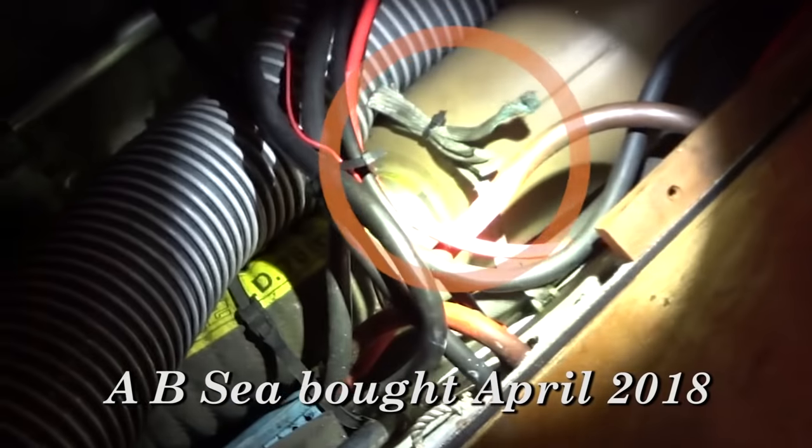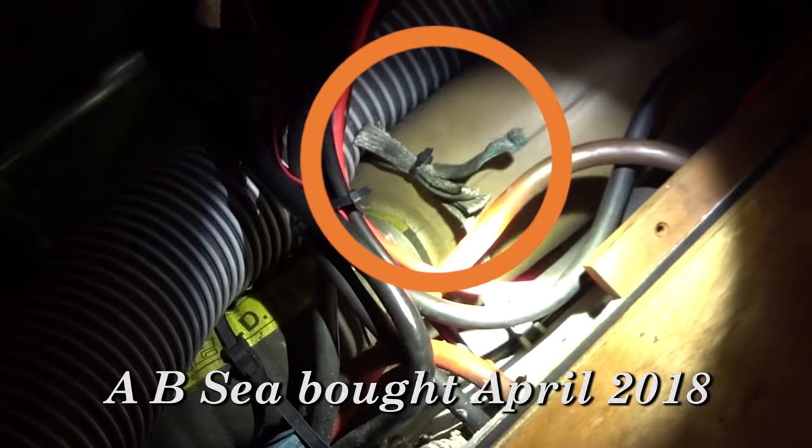A lot of people have also suggested that there's a grounding plate on the hull. Well, we went all over the hull while we were on the hard, and there's certainly no sign of any grounding plate as such. It could be that the P-bracket is the grounding plate. Either way, that earthing strap from the engine body back towards the P-bracket has never been attached since we bought the boat. In fact, it was neatly tucked away somewhere and wrapped up with a cable tie by the previous owners. So I'm just going to reattach it anyway, so I'll show you what I've got to do that job.